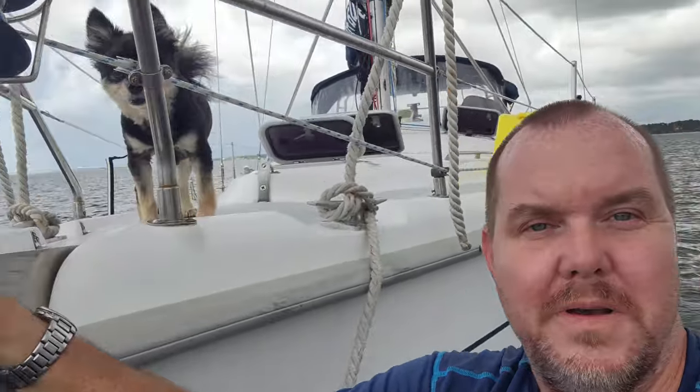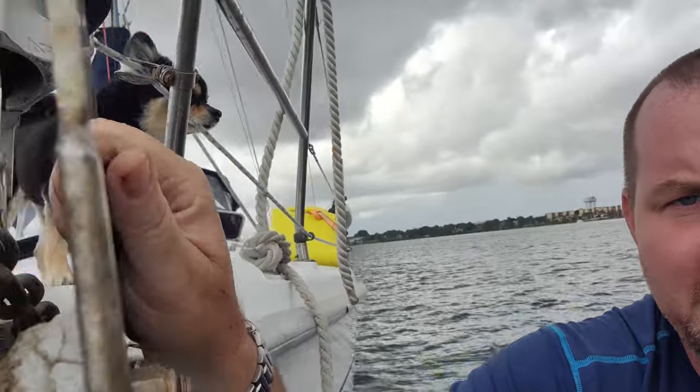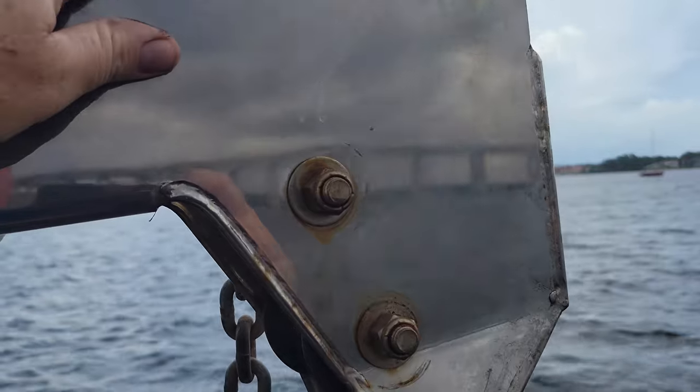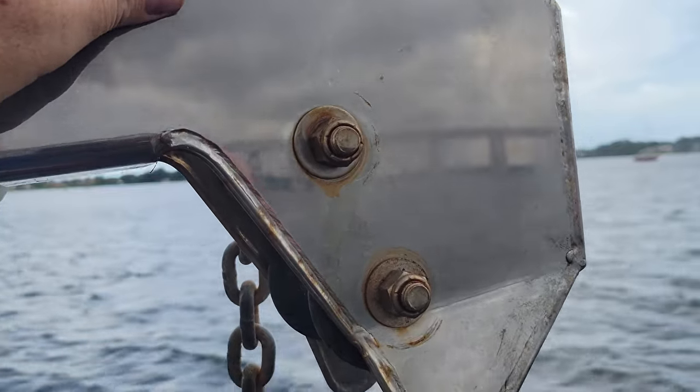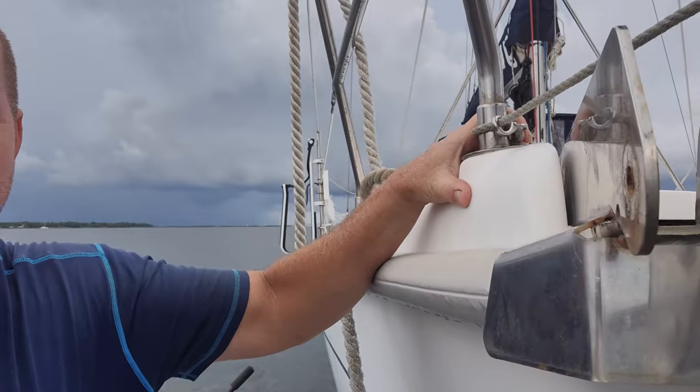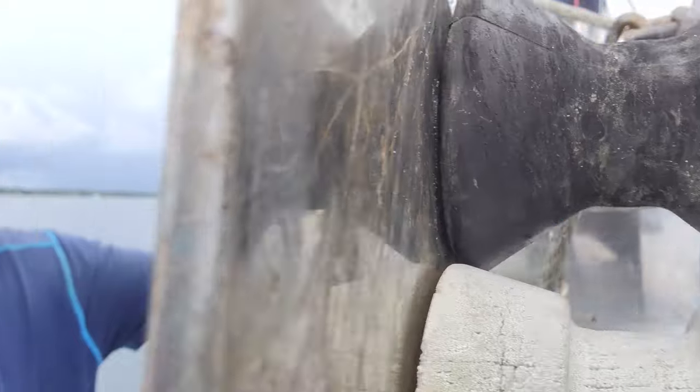On the front of the boat - dog's keeping me company - I'm going to change out this roller right here because it's not rolling. It looks like it's going to rain on me while I'm out here, so let me get this done quickly. To remove it I've got a crescent wrench and I'm just going to take off these outer bolts. Got it replaced, got rained on. I moved the rubber to the top - I had this other roller I took out and put it right there. The rubber rollers were a little too big to put on both together so I had to find another solution, but the anchor should run more smoothly now.